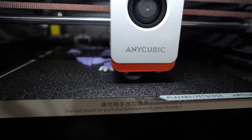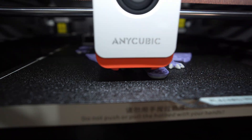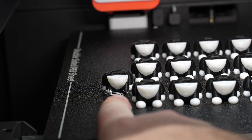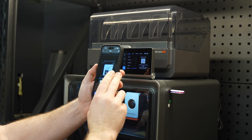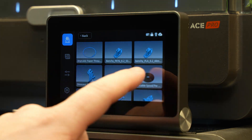Speed-wise, it's rated for 600 millimeters per second, although it runs nice and stable at around the 300 plus range, so it's a fast printer. And despite all that speed, it's actually pretty quiet — it runs at 46 decibels in normal mode and 44 decibels in silent mode. You get all the modern features you'd expect: AI spaghetti detection, cloud account access and remote printing, a 4.3-inch touchscreen that's fast and responsive. Pretty much everything you need is in this machine.